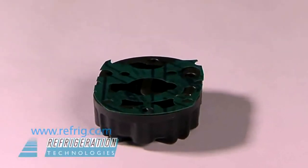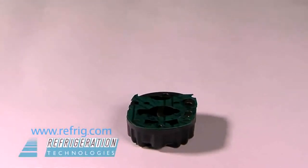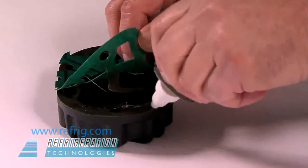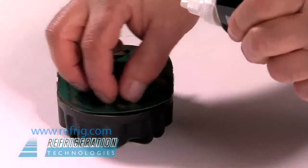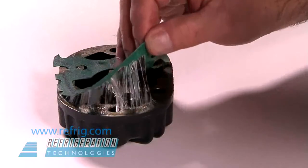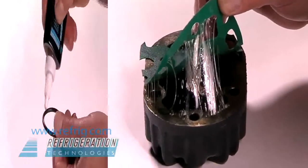Nylog will never harden or dry, ideal for sealing gaskets. The gasket material will soak up the Nylog and never become heat-fixed or turn brittle. Gaskets treated with Nylog can easily be removed many years later. Often the gasket will peel off in one piece and will not require sanding, scraping, or wire brushing. Make sure you treat both sides of the gasket.